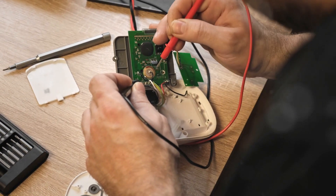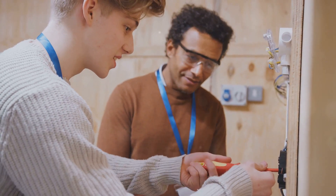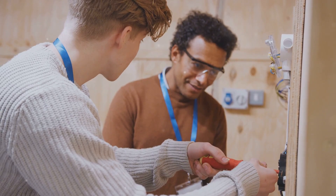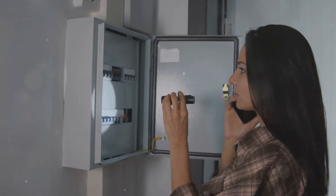Identify the contact you want to check. This could be a switch, a button, a relay, or any other electrical contact. Connect the multimeter leads to the contact. Touch the black lead to one terminal and the red lead to the other terminal.